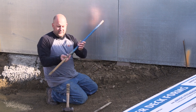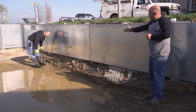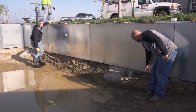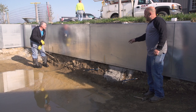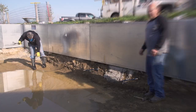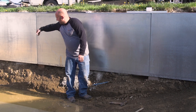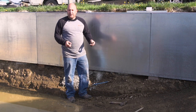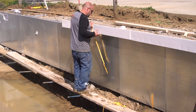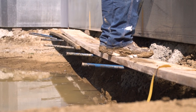So we figured out a way to just drive these pins. If you get a two to three foot pin like these ones here, what Harvey's doing is measuring between the pins, and he's also going to measure off the pool wall. We know the bottom is level, so if he measures off there and puts them all relatively close to the same height, that'll keep the plank more level. We just keep putting these into the bank every four to five feet, and that gives us a nice place to set our two by twelve or an aluminum scaffolding plank — whatever you might have.